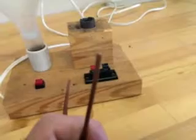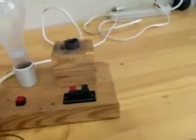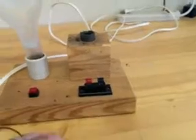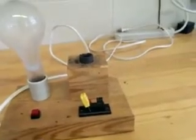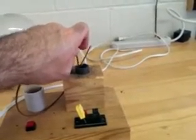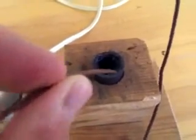You are required to twist the ends of the thermocouple wire together and then come to this homemade thermocouple welder. It is a simple apparatus that allows you to connect your thermocouple wire. Take the other end where you twisted the wires together and stick it in this powder — it will complete a circuit. As you put the tip into the powder and stir it lightly without pressing too hard, you should see it create a spark which will heat the thermocouple wire enough to weld them together.